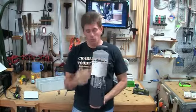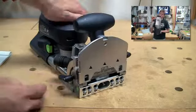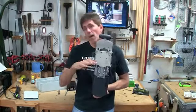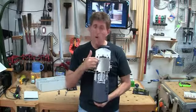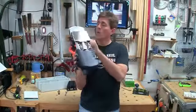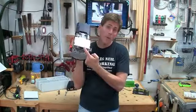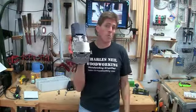Another part of this fence is the registration pins located here. They are retractable — they're retracted right now, but if I press this button, they snap out. You're getting three per side, and you can press them down and retract individual ones, so you can pick and choose the ones you want. The fence also includes registration marks on the bottom: one marks the center of the bit, and additional marks indicate where the pins are located. So if you're marching across using pins as spacing, you can still use these marks to continue in places where the pins can't be used.